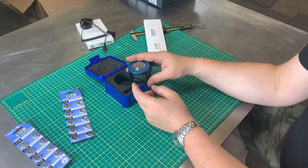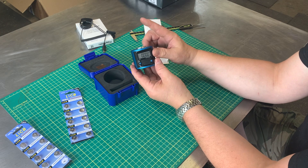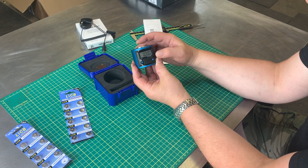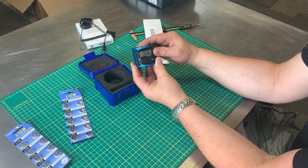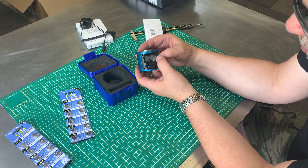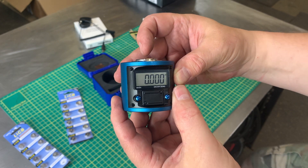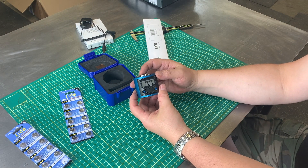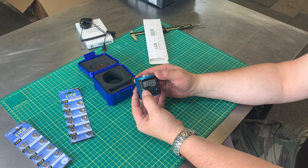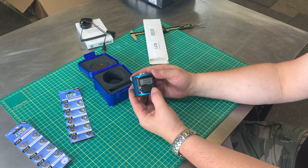What does this thing do? Well, quite frankly, all it does is you can set it on top of your piece of material on your mill and bring your face mill or end mill down to this surface. As you press down, it shows you how much you've pressed. You can do it in millimeters and in inches — I currently have it in inches and it shows right here at the top right. You've got a millimeter-to-inch button here that you can change the value, and here's the on/off and a zero. To turn it on, just press once.